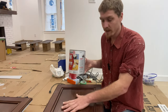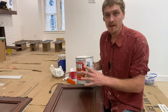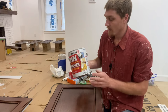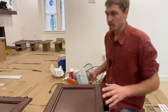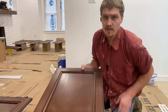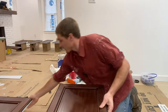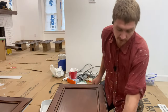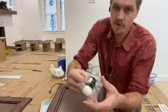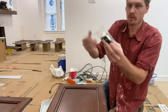I'm going to demonstrate what it's like to paint one of these cabinet doors with this stuff. It dries almost instantly — it's ridiculously fast drying, which makes it really difficult to work with. What I'm doing on these cabinets: I've got some grooves and I'm going for an entirely foam roller finish — I don't want any brush marks. This is the high-density foam roller I have, made for doors and cabinets.